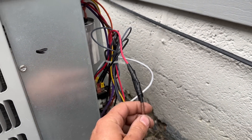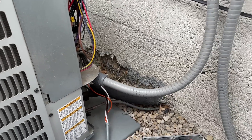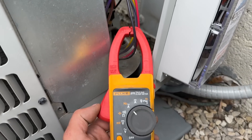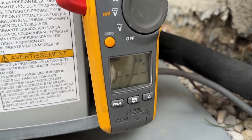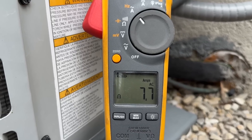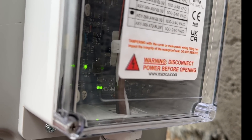We got that connection made, taped up, and tucked in so it's not going to rub on anything. We made sure everything is clear of our cover. We've got our easy start kit mounted to the panel. Putting the disconnect in, we heard our fan come on first, then the AC compressor turned on — 7.7 amps inrush. Wow. Our green LED light is on signifying normal function.